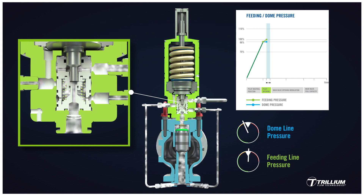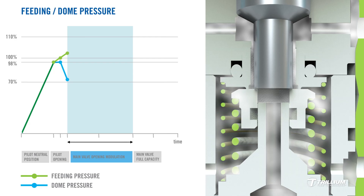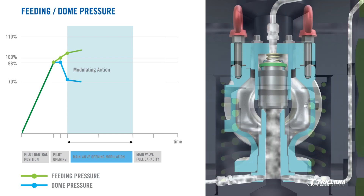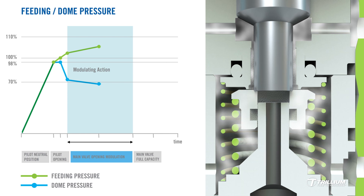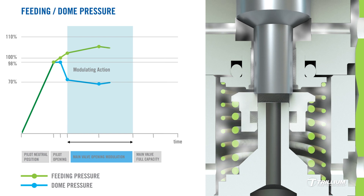When set point is reached, a small amount of overpressure forces the drain spindle upwards to leave its balanced position. The dome is vented and pressure is reduced to 70% of set pressure. The drop in pressure allows the pilot to return into balance. The main valve piston is now also balanced. Modulation can now start. As the inlet pressure continues to rise, the disc will close the feeding seat and the drain spindle will be disengaged from the disc, thus venting the dome. The pilot returns into balance. As inlet pressure starts to decrease, the drain spindle moves downward and leaves its balanced position, allowing the dome pressure to be resupplied. The pilot returns into balance once again.